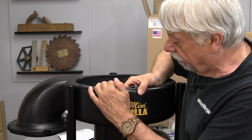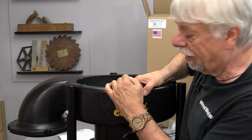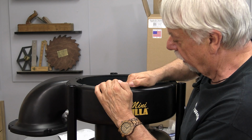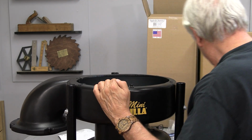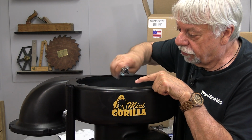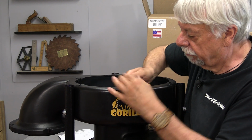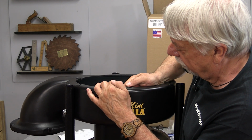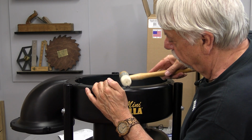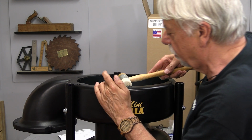And I'm also finding that once I get them started, the best way, because they have to seat, they have to kind of clip in there, and they're a little tough, and I just put that one upside down, that this lip needs to go underneath. Maybe pliers will help that, not really. But push it in, and I'm finding that if I use a rubber mallet, or you could use a wooden mallet, and just tap that into place, it makes sure that it seats.